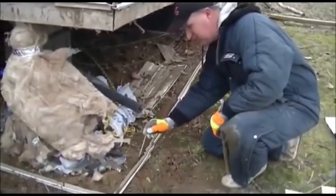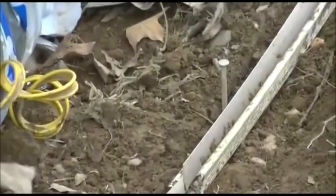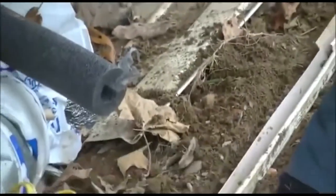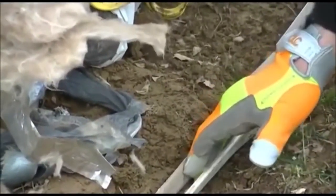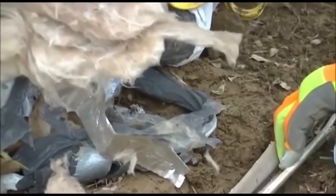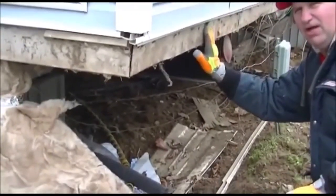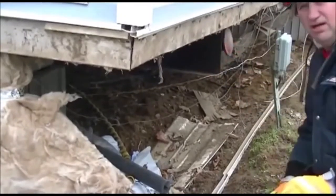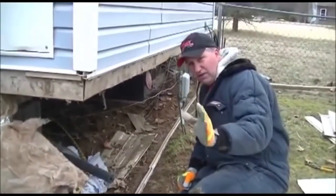Here we are. We didn't put several nails down through here, but I'm going to show you - the nails are right there. Sometimes they're in the middle. You need to get them all down so they'll be out of the way. Now keep in mind, this bottom rail - the back side is higher than the front side, so you can bump up against it and slide down. The metal that we're using is a little bit thicker than the skirting, so we'll end up widening that. Now the top rail - before we get started, you need to make sure it's fastened good. In this case they put vinyl siding over top of masonite, and the masonite rots out real bad. It is fastened real good right here, so I'm going to start on this other end, get measurements, and I'll show you over and over again how I do it.